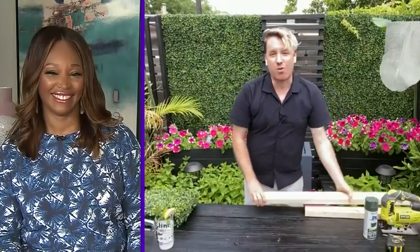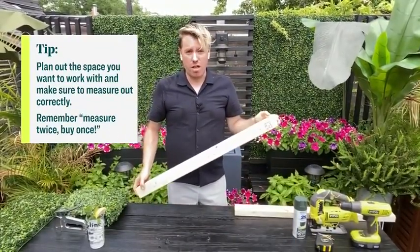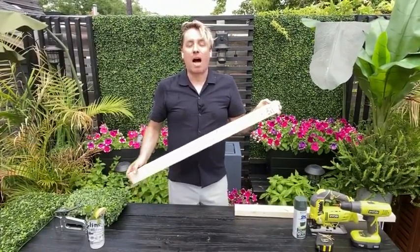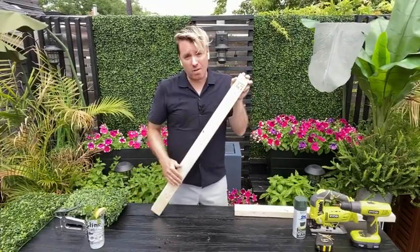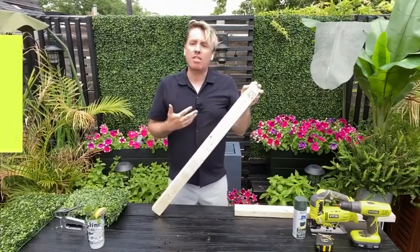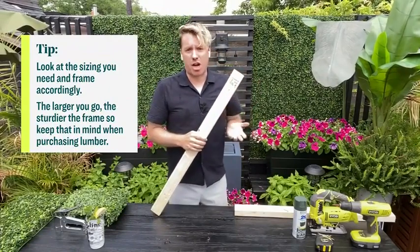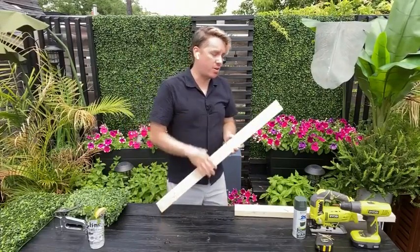So the first thing you're going to do is create a frame out of 2x4 lumber — not plywood. I recommend using something rated for outdoors. If not, make sure you're staining it so it's protected from outdoor weather. Make sure you're consulting a construction or carpenter friend if you're worried about the structure. My panels are not that big, so 2x3s were strong enough, but make sure you consult that.